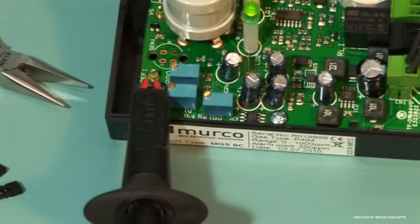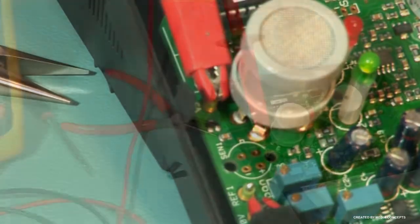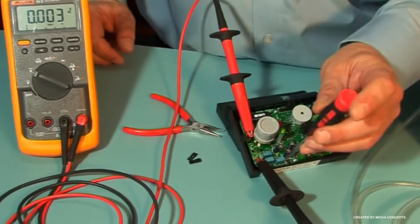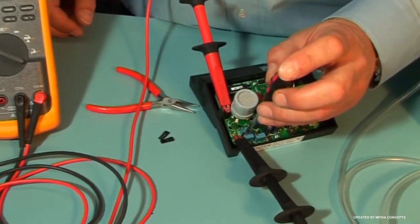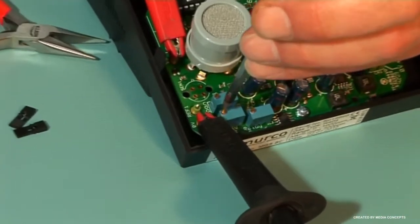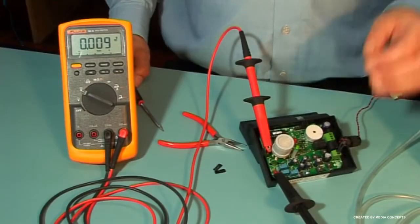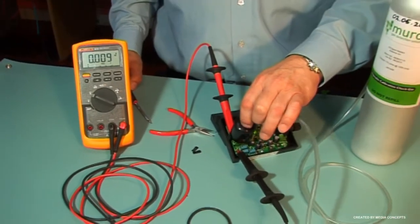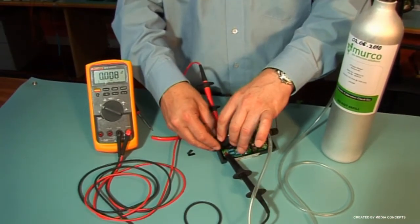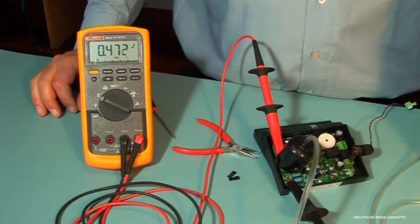Connect the voltmeter between V0 and Vs and adjust P2 to 0 volts if in clean air. Once the sensor starts to see the gas, this voltage should increase. For a quantified test, you need to use a calibration cylinder for the target gas at a concentration as on the rating label or higher. Expose the sensor by introducing gas to the sensor here. You should see the voltage increase. It may take 10 to 15 minutes to reach full scale on the sensor output. Older sensors may take longer.